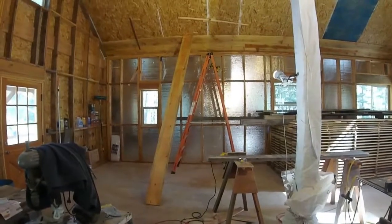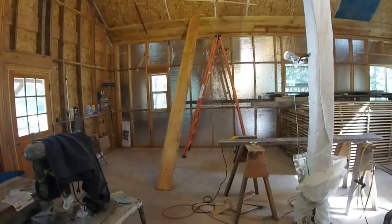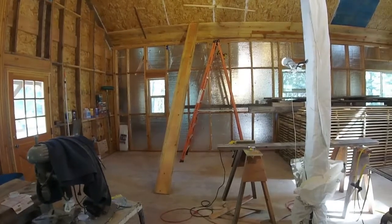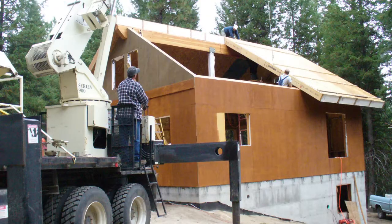This is one way that I can hang boards on a SIP, or structural insulated panel, ceiling. The panels are a sandwich of styrofoam between OSB, and there's a 4x12 beam or rafter embedded at each panel seam. I want my ceiling board fasteners to hit those rafters.